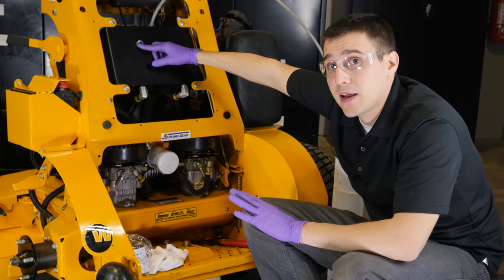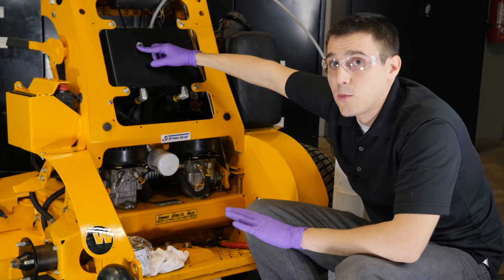That's really all there is to the oil change — it takes a couple of minutes, a little bit of pain, but it's important that you do it regularly. How you operate your machine also has a lot to do with how long it will last. Two things that really deteriorate a system quicker are heat and pressure. You can reduce your peak pressures by not hot rodding — that's hard starts or wheelies on asphalt, which is really not good for your hydro system. The other thing is climbing or dismounting curbs aggressively. It's best to get on and off curbs gently because a sudden jolt will put the whole weight of your machine into pressure and will shorten the life of your system.